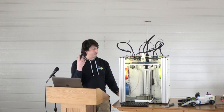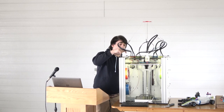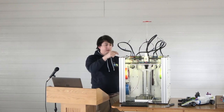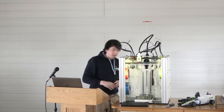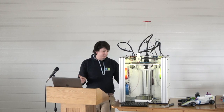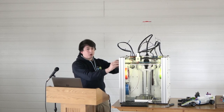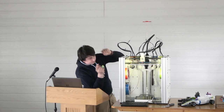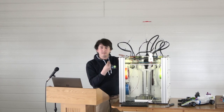There was one more crazy idea I had that I'd forgotten about. We did the camera, we did the thing. Oh, the vacuum. So one of the problems that we have, and BCN3D have the same problem, is that we do have to do a certain amount of purge and prime. And that purge and prime just kind of falls down there. So Greg is adding a solid, oh no, the solid state relay is already in there, but there's not a plug. And what we're going to do is link it up to a shop vac here. And so the Duet firmware will be able to run a macro that turns on the solid state relay, that turns on the shop vac. And so when you're purging, it sucks the material off of the hot end.